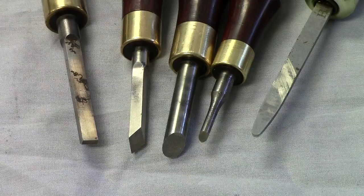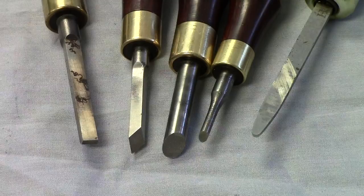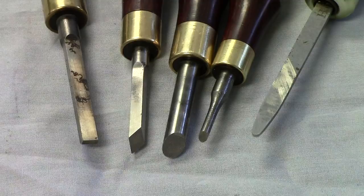And in doing the freehand turning, a couple things to point out. One, I did this turning not on a jeweler's lathe, but on a small 10K South Bend lathe. And I'll show you the two fixtures that I use for a tool rest. The thing that's extremely important when you're doing freehand turning in brass or any other light metal is your tool rest has to be extremely rigid. You can't have any room for spring or bounce. It has to be as solid and as rigid as you can get it.